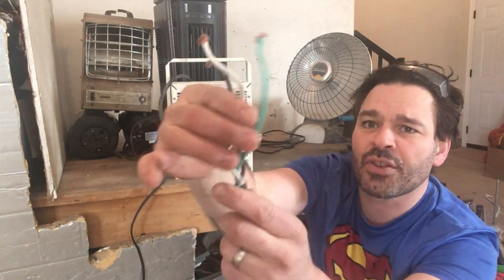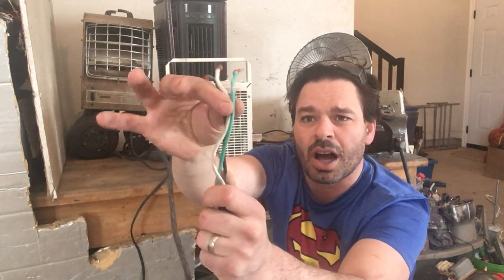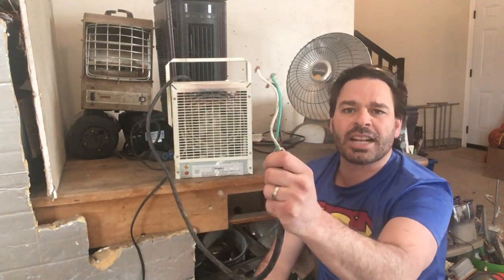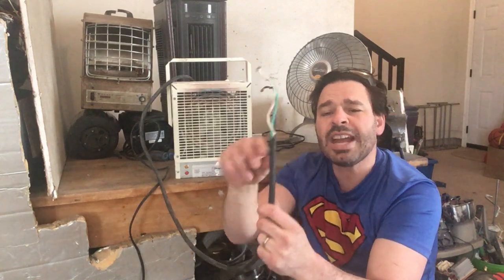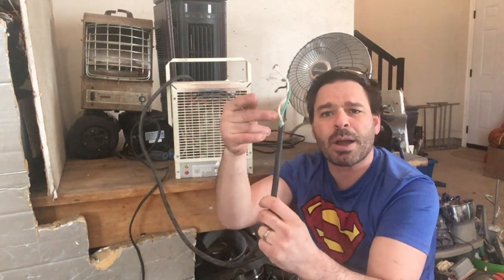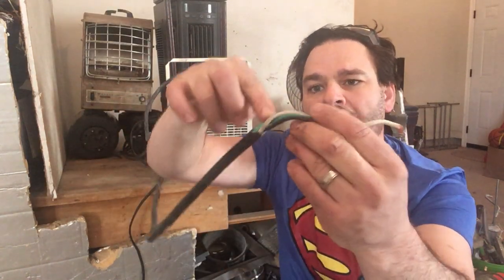Because this has three individual coated strands of copper and an outer coating of plastic, there is higher plastic and less copper. If I was to just have these three coated wires without the outer coating, that is higher copper recovery and less plastic, so those three as standalone would be classified as 60% appliance wire, currently going for $2.19 a pound. In a lot of my videos I talk about not removing the outer shell — cords from appliances like vacuum cleaners, dehumidifiers, and microwaves do have a really nice outer shell plastic, and by removing that I lose a lot of value from the weight of that plastic. This wire, however, has an extremely small or thin plastic coating on it, so this one will be worth taking off.